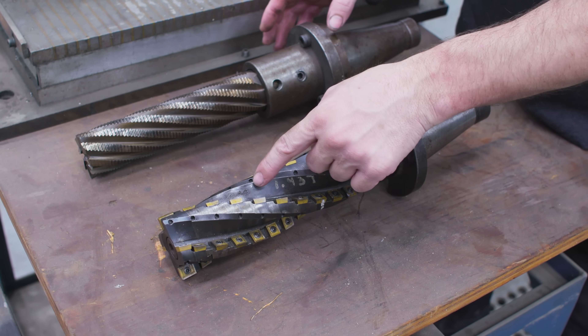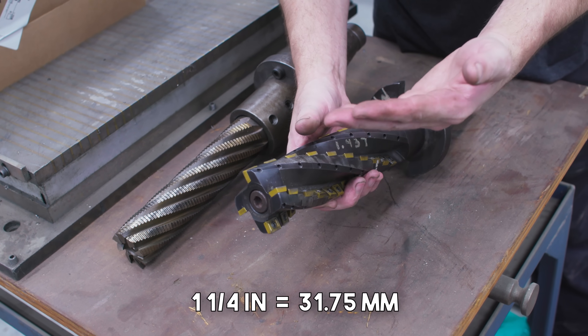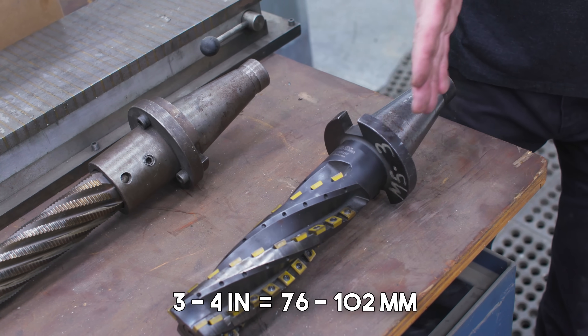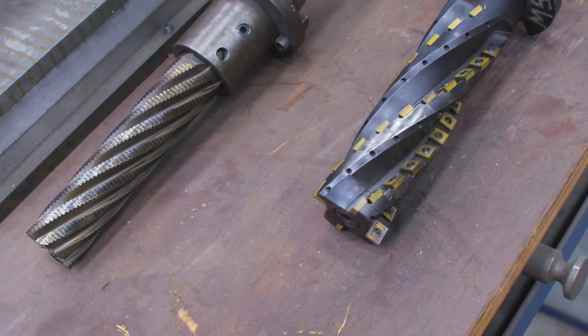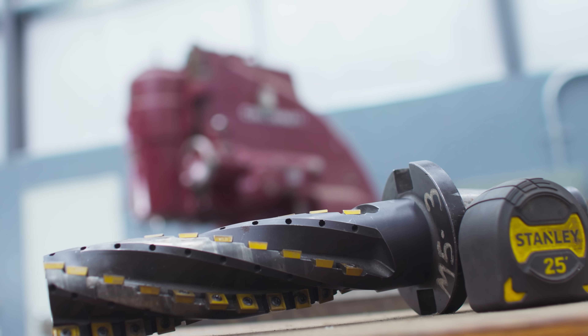So here's my plan for today. I would like to see if this milling machine can take at least half a depth of cut, maybe a full six to eight inches, at a speed of three to four inches per minute — that's double the speed of the other one. So we're gonna see how this bad boy performs in the big Cincinnati.